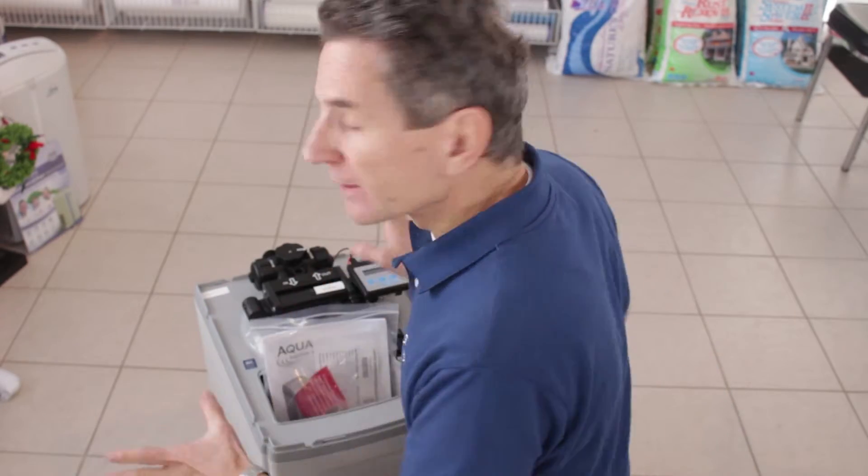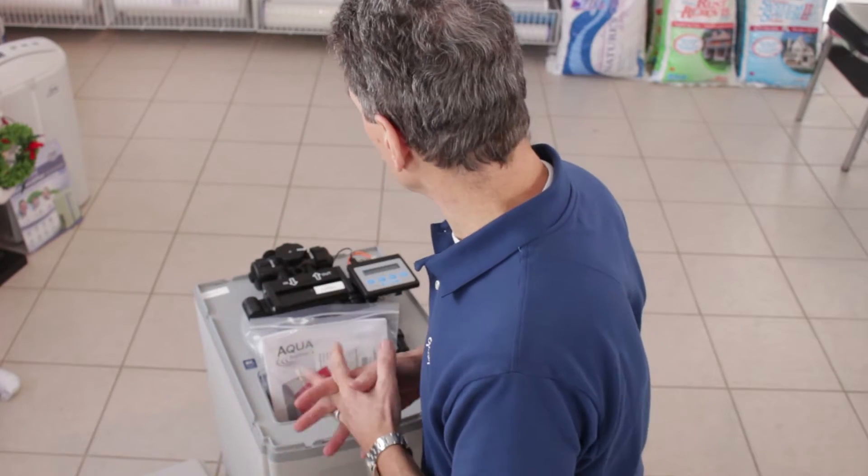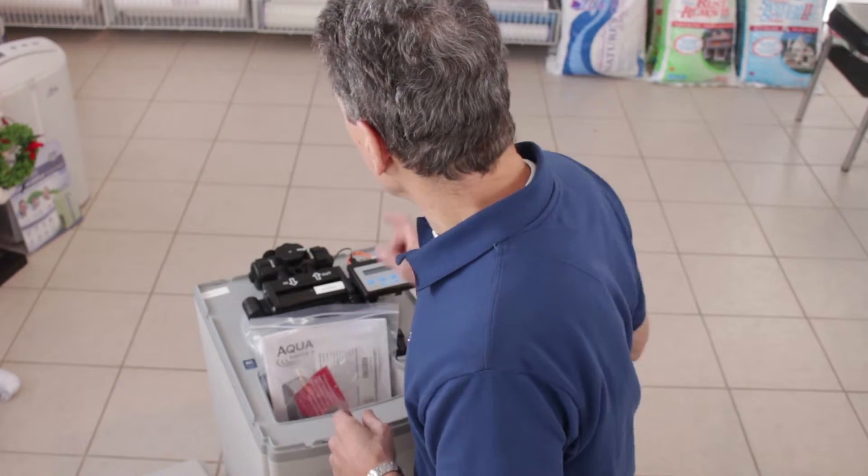In terms of features, I give it an 8 out of 10. It does the job great. It's a fully metered water softener and has a battery — a power cell backup that'll last an incredibly long time. You'll never have to worry about resetting the time, etc. The only feature that it's missing is a days override. Because it's a metered water softener, it will regenerate based on your usage. But sometimes with very low water usage, like in a cottage application, you'd like it to automatically regenerate after 14 or 20 days. That's the only feature that's actually missing.